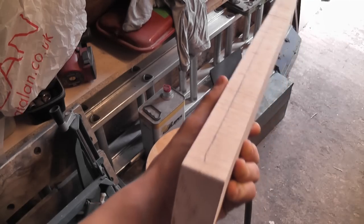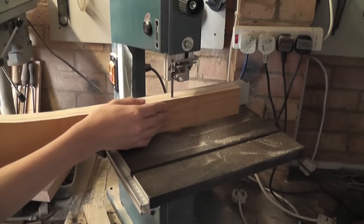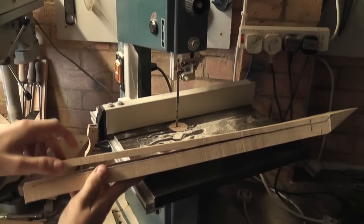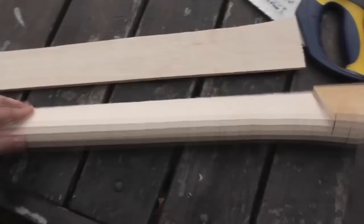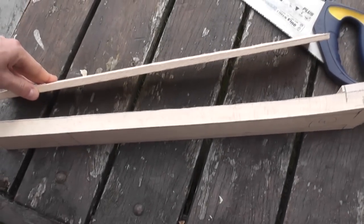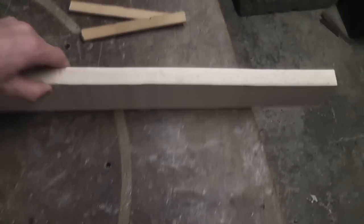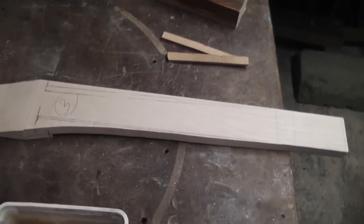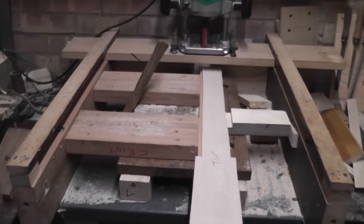So what we're going to do is saw it down the line with the bandsaw. The top needs to be perfectly flat so we can stick the fretboard on. The back needs to also be perfectly flat so we can use it to locate on our jigs to cut things like the headstock angle and anything that goes on top. So whichever way we put our template, we need the flat bit on both sides. What I've done is wedge it up in my router table so I can route the faces perfectly flat.